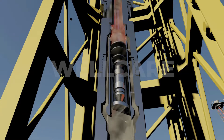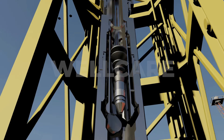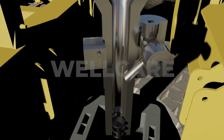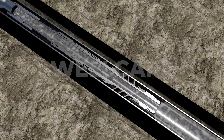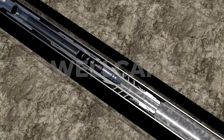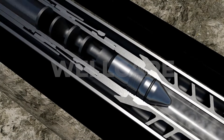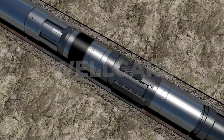After the proper amount of cement has been displaced, the pump down plug is released from surface by a rotating valve in the cementing head. It will separate the cement from the displacement fluid and wipe the inside of the drill pipe. The retrievable pack off bushing forces the cement down by keeping a pressure-tight seal on the liner top, towards the liner shoe and into the annulus between the liner and open hole. The pump down plug will latch into the liner wiper plug, indicated by a pressure increase, subsequent to which the two plugs as one combination move down and clean the liner ID. Together they create a barrier between the displacement fluid and cement, wiping the liner clean and keeping the cement from being contaminated.